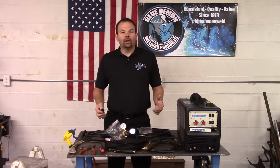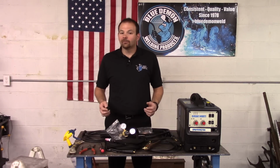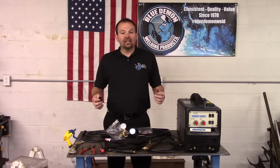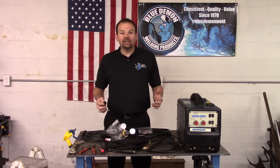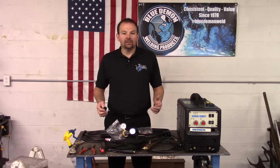When operating your welder, you will need to have a general awareness of how much time you actually spend welding. When using the MIG process, the duty cycle of this unit is 30% at 90 amps. This means out of 10 minutes, you can weld at 90 amps for approximately 3 minutes before you will need to allow your machine to cool for the remaining 7 minutes.